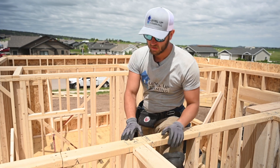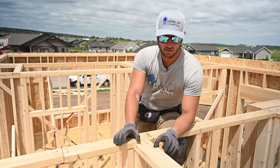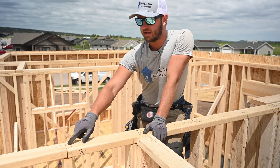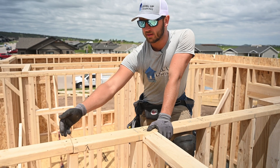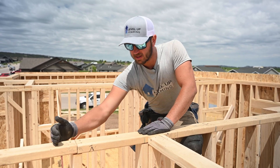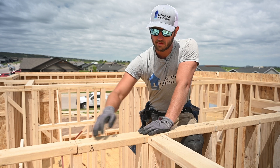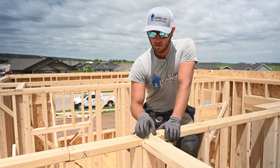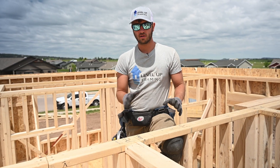When we're double top plating, the goal is to lock everything together. Right here you can see we have a break in our plate and it's spread a little bit. When we double top plate, we want to tie this together, nailed on both sides. We want to stop it here so we can tie this wall in, which makes your walls really sturdy.